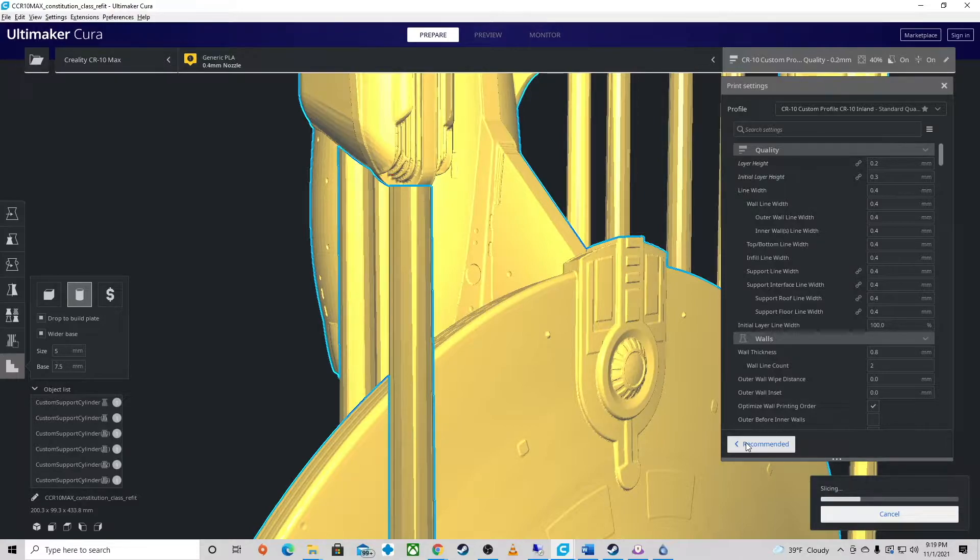This is a big model the way I'm doing it — 50% of its normal size going on a CR-10 Max at full height. I could probably have angled it and gotten a little bit bigger, but I get consistent print results going this direction. You probably could flip it over, but I don't know if I'd want that much saucer section weight dragging on top. So: 508 grams, two days print time — that's about correct for what it took me.